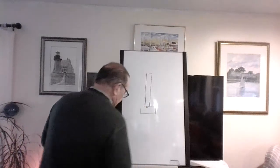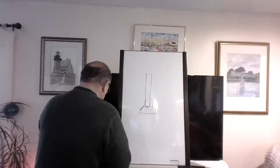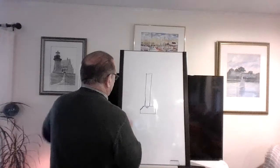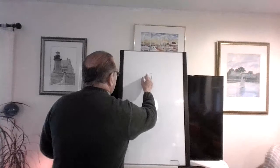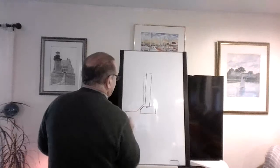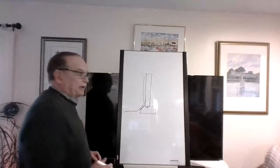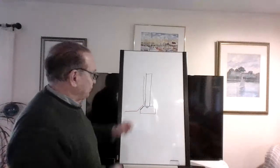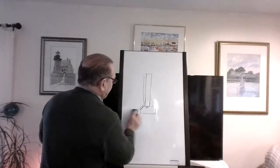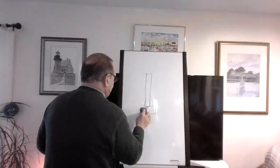sometimes you can kind of nip off the end of it like that. And the reason you did that, even that's a little bit much, is so that you can run a pipe down the wall and right by here, okay? And over like that. You want to keep it tucked in. And if the point is here, you got to kick the pipe out that much more. Okay? So if you have to, you can just kind of nip off the end of it like that. That's a little exaggerated. Don't want the building inspector coming down on you, so don't take too much. Okay.